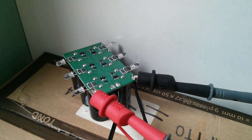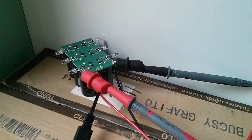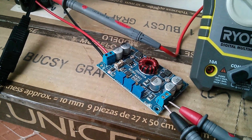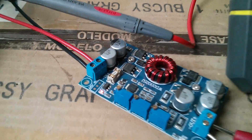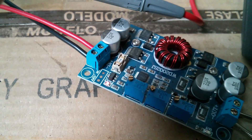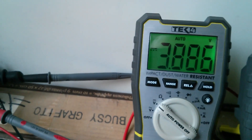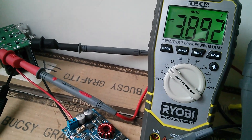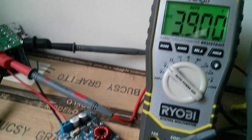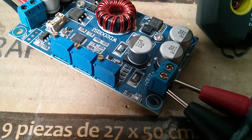Actually a bit more because those protection circuits kick in a bit late. Now also connected to that supercapacitor bank, I've got one of these — it's an LTC 3780, I think that's what it's called — a buck boost converter. And it's got its fault LED on because I think it's saying that the input voltage is not sufficient for it to start generating an output. I've just looked on eBay and they reckon that the minimum voltage on the input is 5 volts and we've only got 3.9.